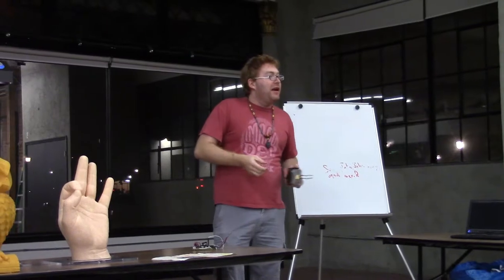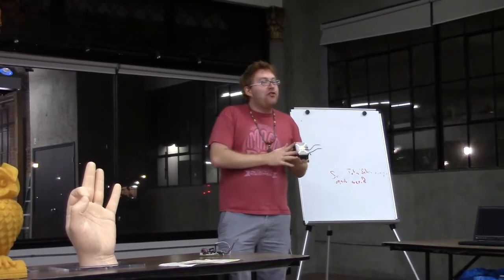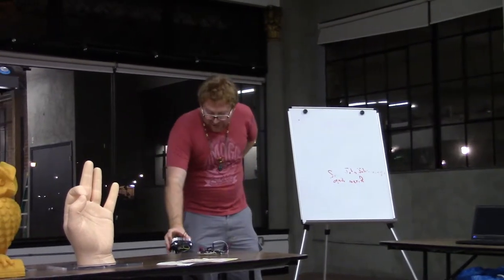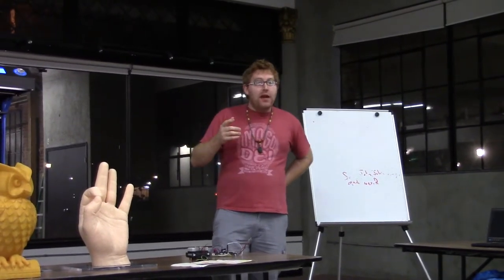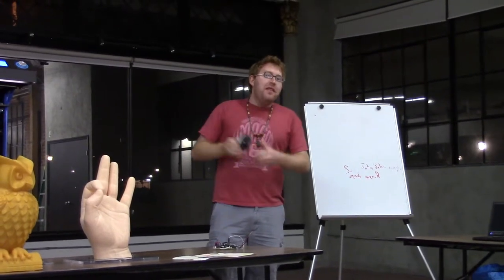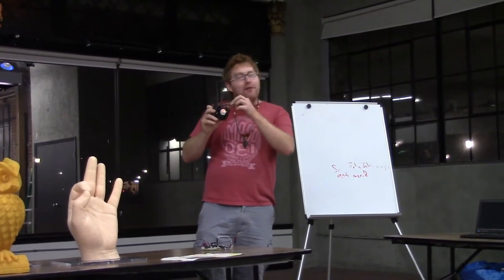So then I got some thermal adhesive and pasted it to this guy, and now it won't overheat until about a half an hour later when it's completely saturated this heatsink with heat and then continues to overheat. It'll saturate that? Yes, it will saturate this to the point where you can get a nice little burn from touching it. The fan on the back will solve that, but I haven't wired it up yet.